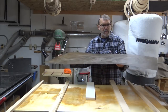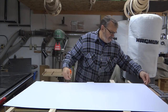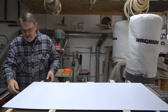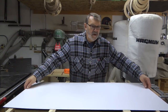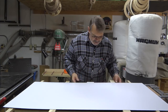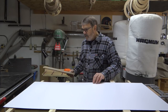Now what I want to do is lay this glue side down on these strips. Then I have to make sure that it's centered so that I'm not leaving anything uncovered. And I only get one shot at this. Contact cement bonds instantly, and I don't want to go back to doing what I did to get the other piece off. Now I should always start from the center, so I'm going to pull out the middle one